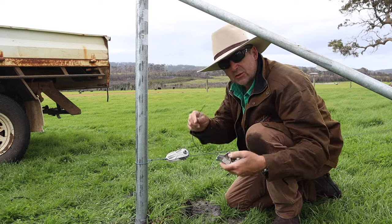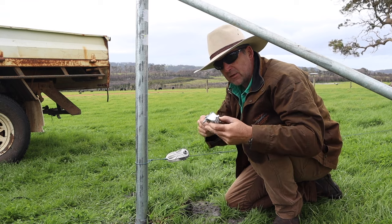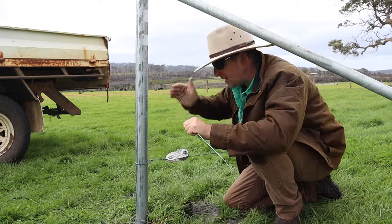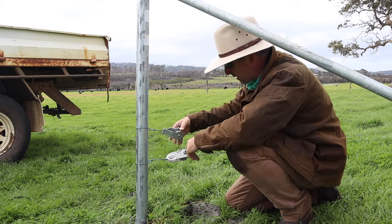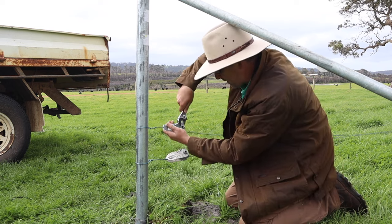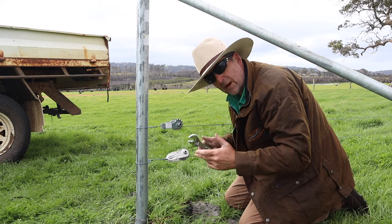This is a good opportunity to show you a trick with strainers that Murray Green from Western Australia showed me. We're going to use this ratchet strainer in a very unusual way. The first thing we're going to do is thread it on the side of the nut and then continue to thread right through the front yoke of the strainer that's normally used to tie off to the post. We're just going to pull this strainer down the wire and leave it alone for a while. Tie it off as normal and then — because we've got the front threaded and we've got the barrel threaded — we're simply going to turn this into an inline wire strainer. It's not connected to the post except by the wire that it's tightening up. This makes tying off to the post and straining with a ratchet strainer far simpler with far fewer moving parts and far fewer knots to tie.